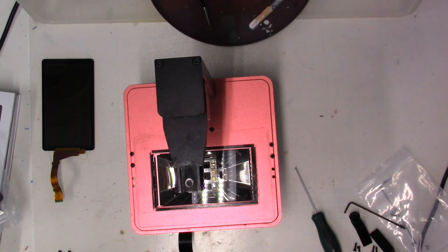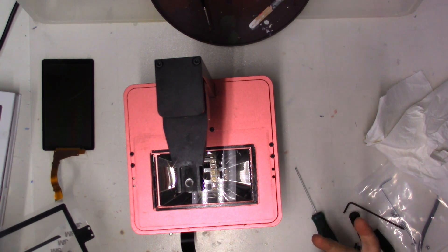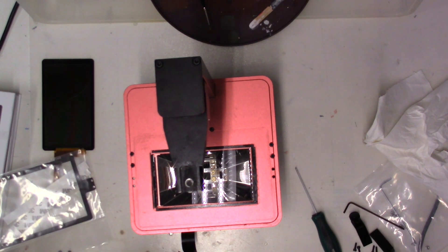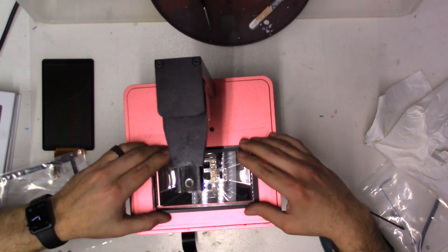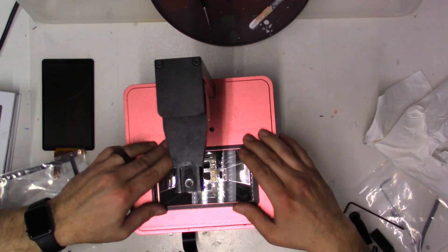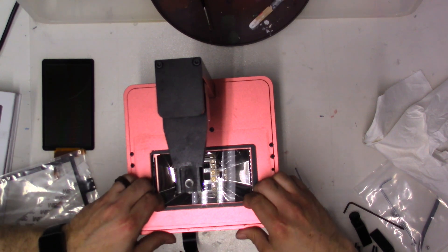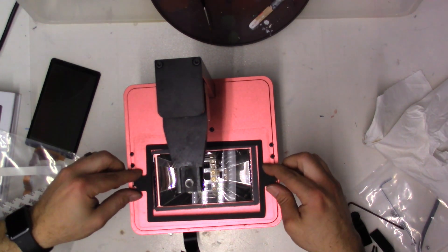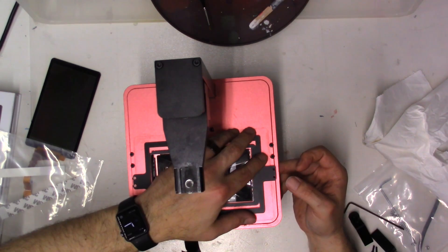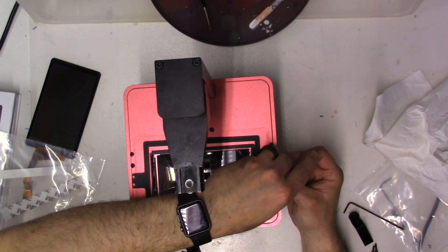Now that's done. It did come with some tape to put along the edges, but this has been pretty sticky — this is the second screen I've changed. So I'm just going to place the new screen right over here instead of trying to take all that tape off; it's plenty sticky. Line up those holes, then take those screws and put the vat holders right back on.